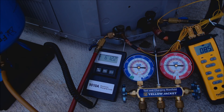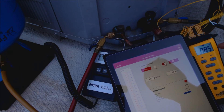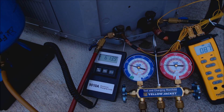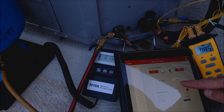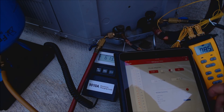Our temperature is now at 85. We're at about 192 PSIG. So we got 192 and 94 degrees roughly — 94 minus 85 gives us nine degrees of sub-cooling. That's good. We're calling for eight and we got nine, so we're good to go. That refrigerant charge is good. I'm now going to shut the valve at the bottle and weigh the remaining refrigerant in the hose into the vapor line as well, while still monitoring sub-cooling to make sure I'm within three degrees and don't overcharge it.